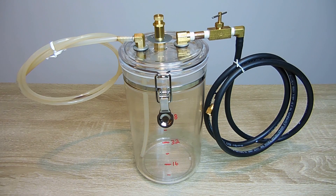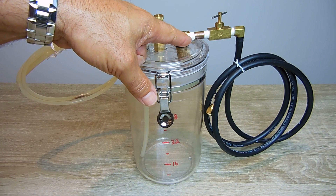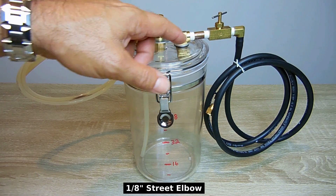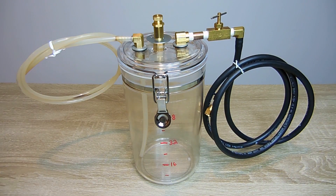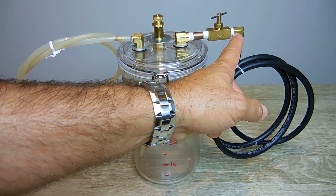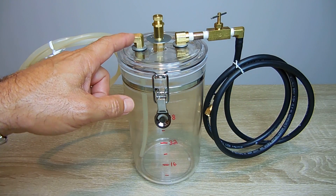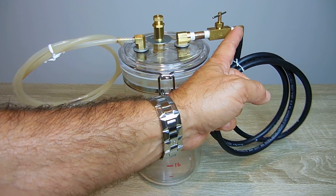If you choose to do it this way, you're going to have the 1/8-inch male going to the 1/8-inch female — it's a 90-degree fitting — a very short length of 1/8-inch pipe, I think that's 1-3/4 to 2 inches. This valve is a 1/8-inch valve, and then over here is another fitting: 1/8-inch pipe going to 3/16-inch.